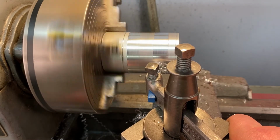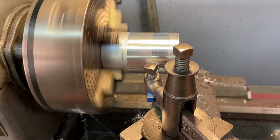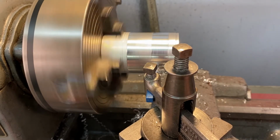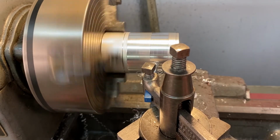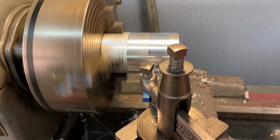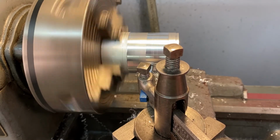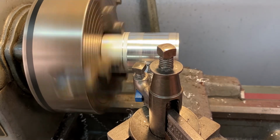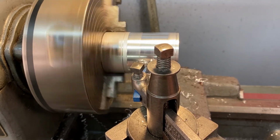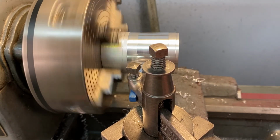And then you got this white line that came in there because my bit either moved a tiny bit, which it probably does. It's probably vibrating in there, so it's going to cut a little bit deeper, and that's why you get scratches. That's called chatter, when the bit's moving around and bouncing around. And then you hear it squeak a little bit. So if you were a machine, you could consistently go forward and you would have no lines on there.